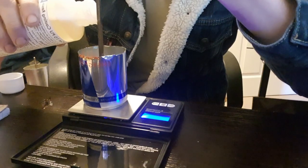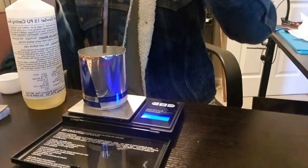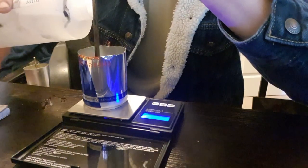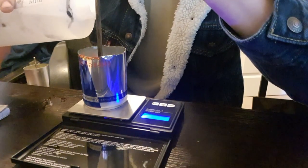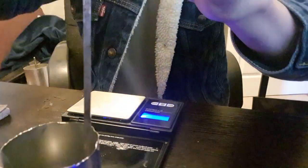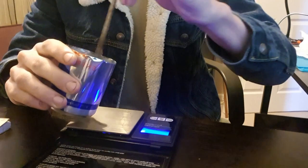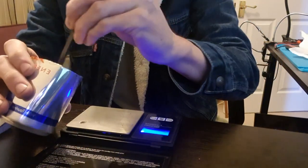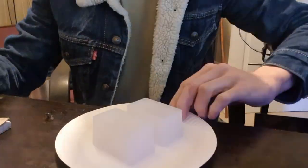Then what you'll want to do is add an additional 20% of acetone. I'm not including that in the 100% because ideally the acetone will evaporate and you won't have to account for its weight after the fact. So that'll be 40 grams iron powder, 5 grams of part A of polyurethane, 5 grams of part B of polyurethane, and then 10 grams of acetone. And then it should be liquid enough to pour into your mold.